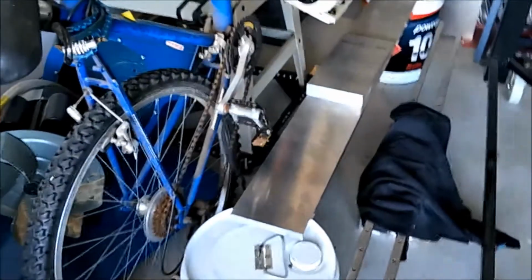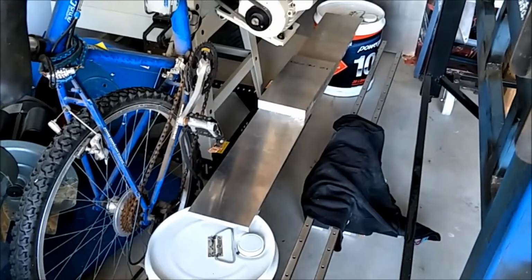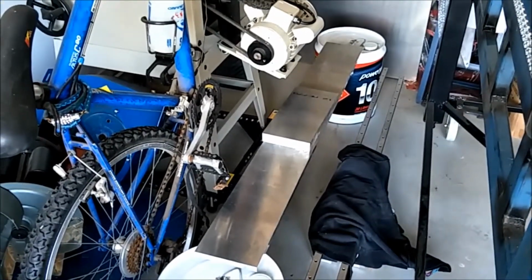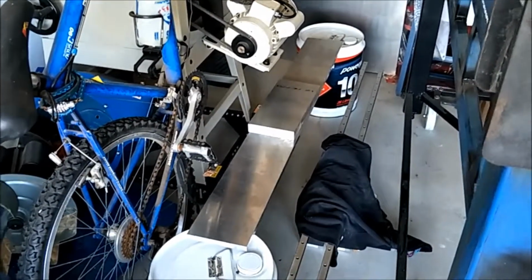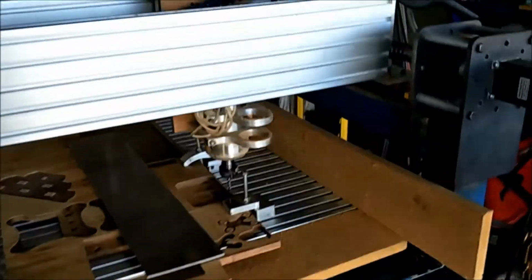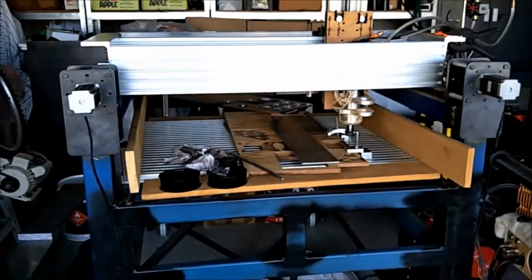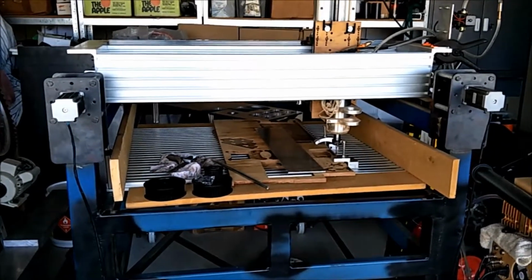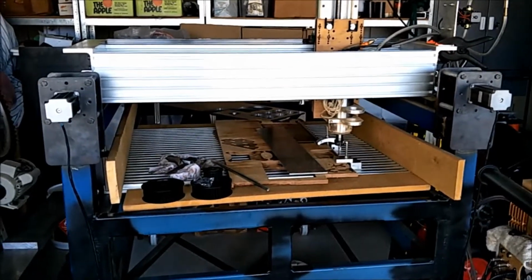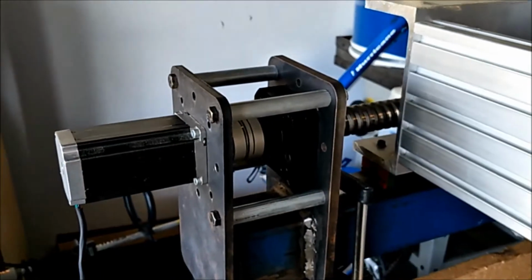What I will be doing is running some kind of plate between this guy and that guy, and the motor is going to sit somewhere in the middle. I did go out the other day and buy some aluminium to make the plate out of. That's 16mm aluminium plate, and the other one's 32mm that's sitting on top of it. But I'm half thinking I'd like to probably do it out of steel, even though the aluminium would probably do the trick. There's no real concern, you know, the thing's not going to move any. That this thing is well and truly made. There's no need to really even have it there. It's just that I like to make it out of steel just because I feel better about it. So without further ado, I'll take this guy off and see if these pulleys fit on.